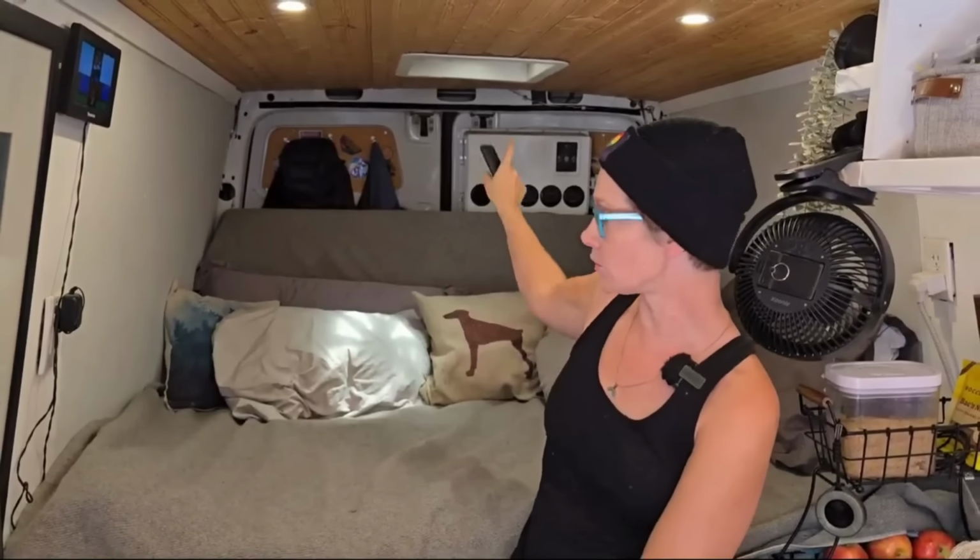So Keri, you've told us all the positive things about the unit and that you love it. Are there any negatives or things that we should know about? Yeah, so there was a comment that came up a lot, which was to remove the thermostat from the unit and move it external so that it would balance temperature a little bit better. Unfortunately, there isn't an easy way to move the thermostat away from the unit. And so we still kind of have that problem where one side of the van might be a different temp, whereas the AC unit in the back is going to maintain it. So you could have a differential in the van of about 10 degrees.